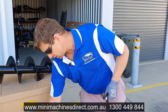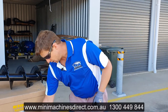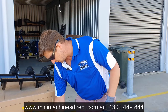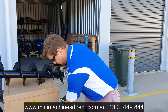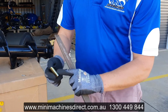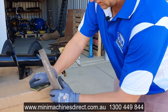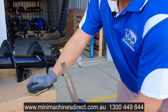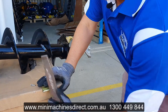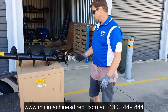There are different types of teeth: the flat tungsten, the normal tungsten, and the chisel tungsten. The tungsten is a lot harder than standard metal — I'll prove that here. Take a file, and the tungsten is only this part here that's welded onto the teeth. You can see it wears away at the metal, not the tungsten. The tungsten tip is definitely a lot harder, so you get a lot more wear life out of them.